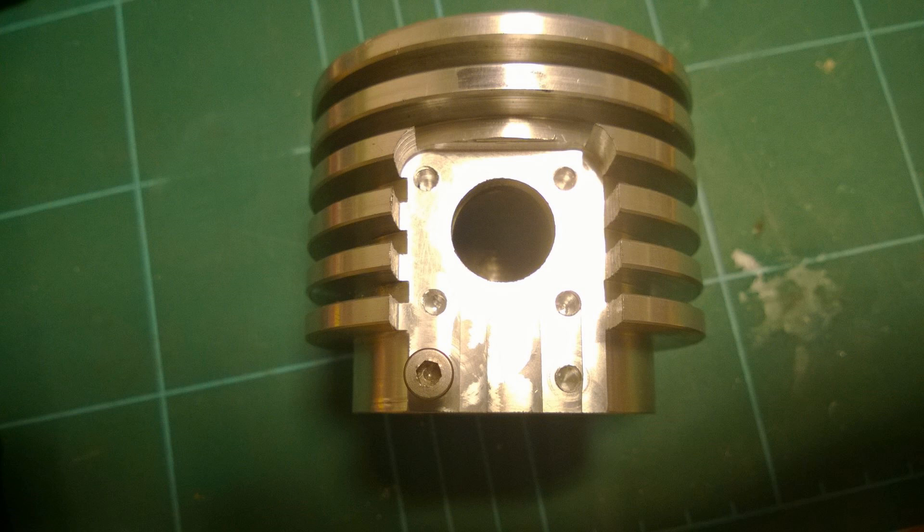And there you have it — that's the transfer port side of things done. In the next video we'll be doing the exhaust port, which is symmetrical and about half this size, but still machined to 13mm depth. Once we've done the exhaust port I can do the transfer port cover, and then we can start looking at carbs and all the rest of it. Thanks for your patience — please leave comments if you have questions, and I'll see you in a bit.